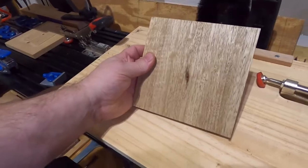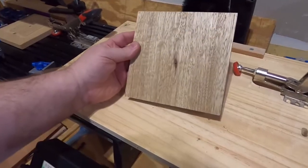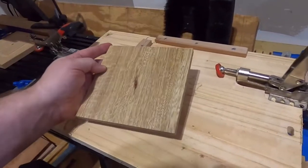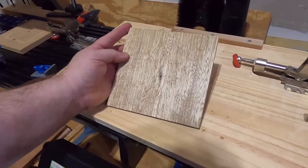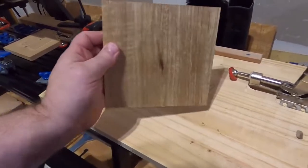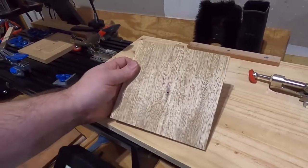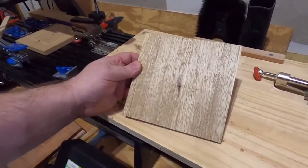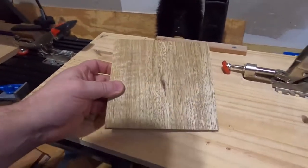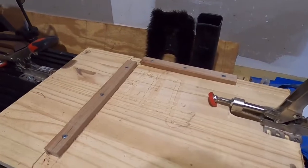One of the things I first found out when starting out is: if you're counting on a square piece and it's not square, things will get skewed. We could talk all about making sure you have consistent work pieces and how to square things up, and not counting on things you buy at a store to be square. So you definitely want these types of jigs with a solid stopping point.